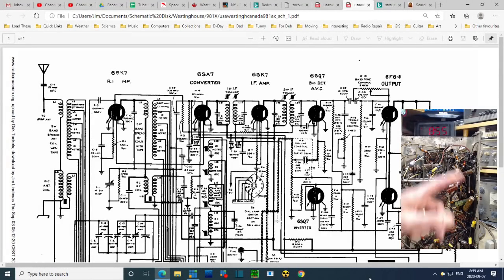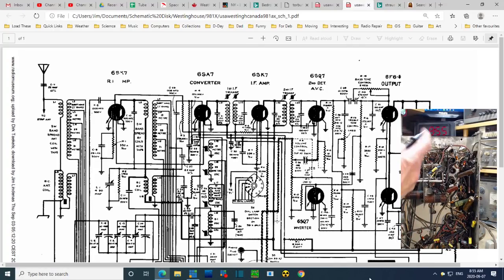Okay, so looking in the little image here, I've cut away the capacitor, and there's the bypass resistor there. I'm sorry, the cathode resistor. Bypass capacitor, cathode resistor, and when I measure its resistance with this very annoying auto-ranging meter, I get 477. On the schematic, if you look here, it sure looks like 330 to me. Let's see, body and dot. So body, this guy is orange, so that's 3. So it's 330, but it's actually coming in at 500, so that's a little high. I think I'm going to replace that resistor too. Well, we'll put in the 330 that's really supposed to be there.